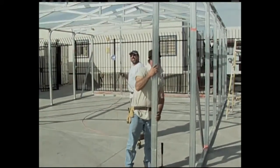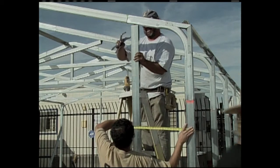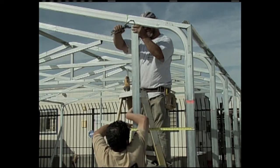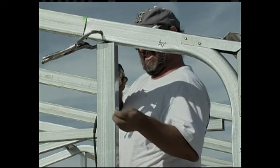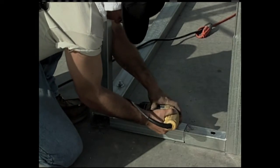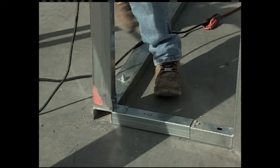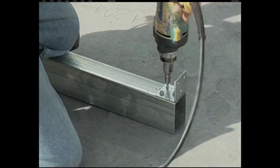Insert your uprights and attach them at the inside top like you did on the back enclosure. In this building, two of the uprights are going to be made of two inch by three inch tube. Those are the verticals for your garage door opening and those will slip into the pins of the L brackets. Attach each end of the front base rail assembly to the side base rail pins with the flat angle brackets, just as you did on the back enclosure.